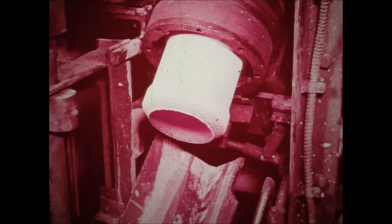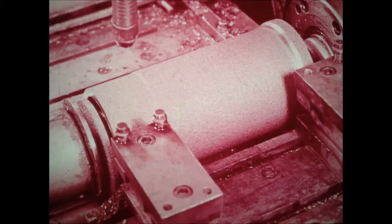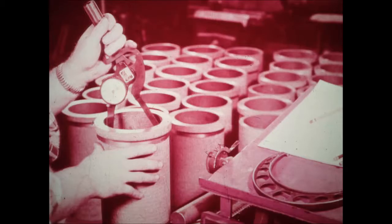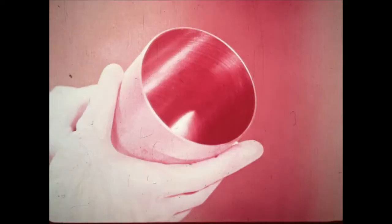The mold is spun at high speed, forcing the molten metal into a perfect cylindrical shape. This method of casting, coupled with high accuracy machining, gives you still more assurance of steady, uniform power. The same painstaking control and inspection is used throughout the manufacture of IH sleeves. The nickel chrome casting is stress relieved, and the outside diameters are machined to exceptionally close tolerances. But the critical inside surface is accurately honed to the same lab standard dimensions used for lapping in the rings.